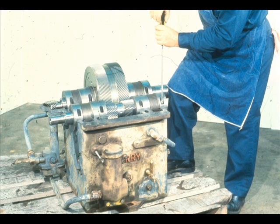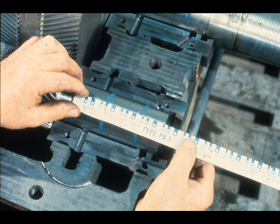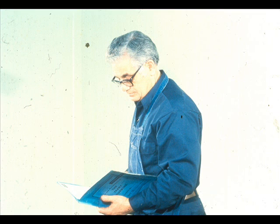After completing your check of the bearing pinch, remove the bolts securing the top halves of the sleeve bearings to the bottom halves. Lift the top halves of the sleeve bearings straight up off the shaft, being very careful not to move the plastic gauge while doing so. The oil you applied to the bearing earlier should prevent it from sticking. Now measure the width of the plastic gauge directly on top of the shaft bearing journal, utilizing the scale on the plastic gauge package. The scale converts the width to the actual clearance between the shaft journal and bearing. Compare the clearance indicated by the plastic gauge to the specifications set forth in the manufacturer's manual. If adjustments are necessary, refer to the manual for instructions on action to be taken.